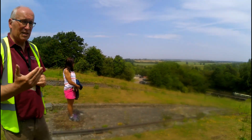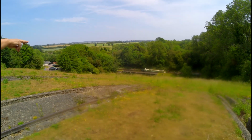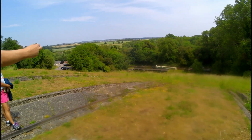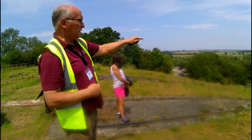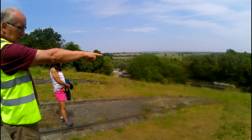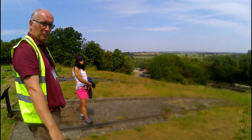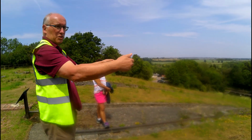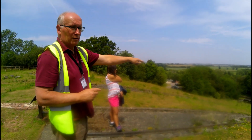You can see what he does, because where we're standing, we've moved from a slope, which is the gradient is fairly constant, to a curved top. As that caisson is going deeper and deeper into the water down there, the gradient here is reducing and reducing and reducing until it's almost horizontal. So that's the solution he's putting in. He's putting a curved top to his slope to compensate for the caisson going in there.